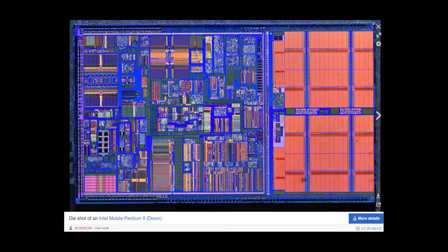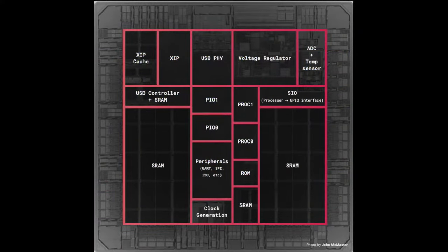One of the issues with chips — this die shot is great because you can see it's like a RAM bank or flash bank on the side. When you buy chips, you're buying pins and processor speed. A Cortex M0 is less expensive than an M4, which is less expensive than an M7. The more processor speed, the more you pay; the more pins, the more you pay; and the more flash and RAM, the more you pay. The problem with flash and RAM built into the chip — this is an RP2040 — it takes up significant die space. Chip manufacturers want to optimize space because you pay for die size. They want to include as little SRAM or flash as possible to get a smaller die, more chips per wafer, and better yield.